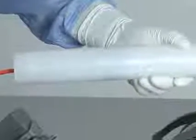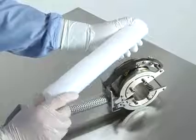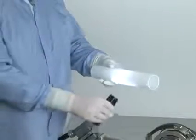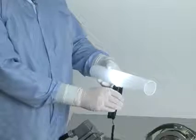The bladder automatically deflates and can be retrieved by pulling on the red air supply line. Weld inspection is done by simply backlighting the weld area and looking for voids, gaps, or trapped contamination. After inspection, apply the printed identification label and move on to the next weld.